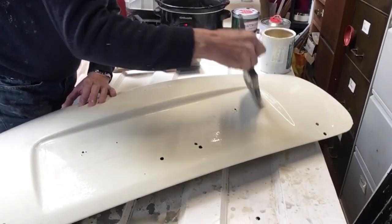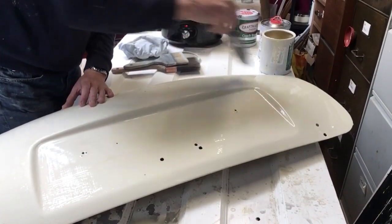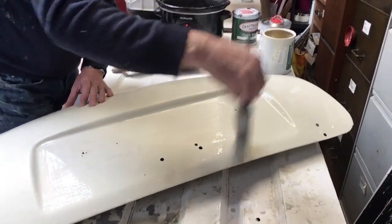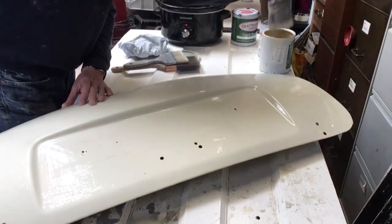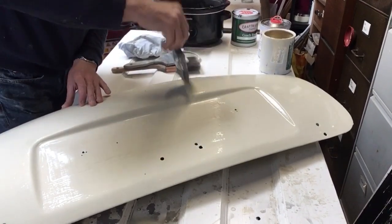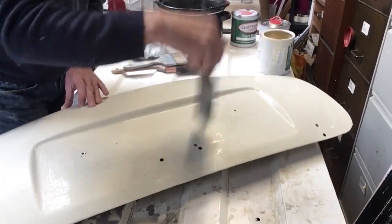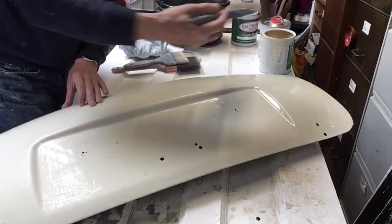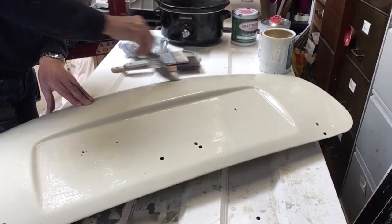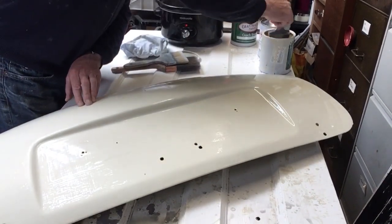You don't have to worry too much about runs, because if you want to build up the layers the runs don't really matter. You can rub it back when you put the next layer on. I'm just running it across now. You can see the lines disappear in front of your eyes — it's fantastic. You smooth it gently on the wet edge and the brush marks just vanish.